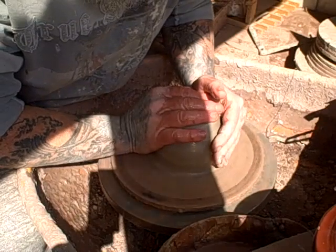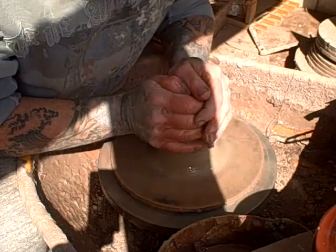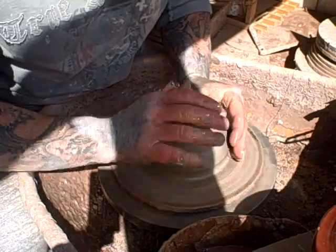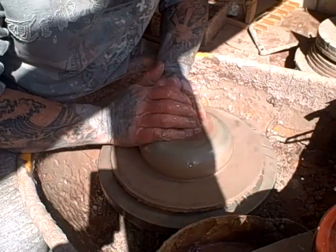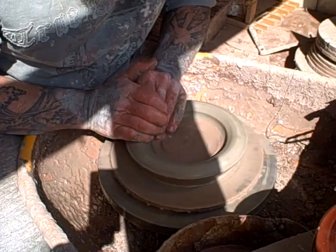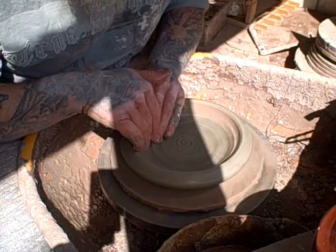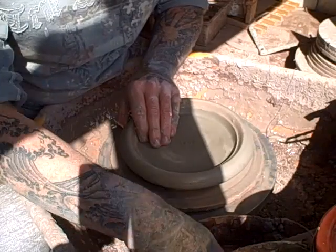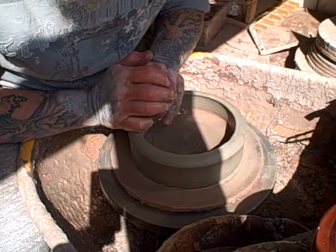This is one and a half kilos of clay — I've just mixed and wedged it up especially for this job, because it needs to handle thermal shock in and out of the oven. I've mixed it 50/50 crank and normal stoneware. I'm going to have a flat bottom on it and I'm throwing it on a bat because I won't be able to lift it off — it's a bit too wide.